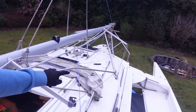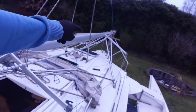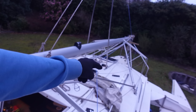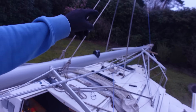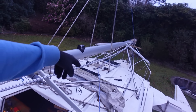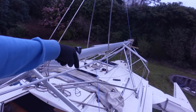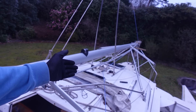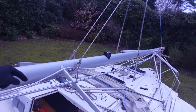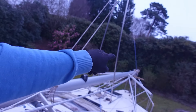I think I've got it all set up now - put the pins in, they just reached, they're quite tight. I'm not sure whether the big pole is too long because I have a lot of adjustment in the shorter ones, but we'll only find out when I put it up. Because if it doesn't touch the base that means they're too long. I read in the instruction manual that this frame, if it's too far back on the tracks, it can actually pull off and rip the track off. So you've got to be careful - it said four inches from the end the second locking hole has to be fitted. I did also lengthen these ones, so fingers crossed. You can see how the furling system kind of lays off to the side, so hopefully that stays there - there's like a little guiding fork at the front which holds it.